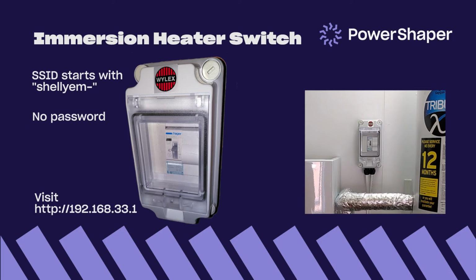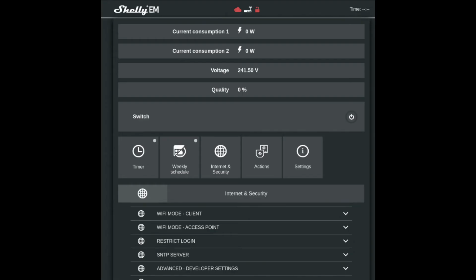192.168.33.1. You will see this screen. It can be slightly different depending on firmware version. You might want to check here that if you press that little switch button that you can hear the Shelly relay clunking on and off. That shows that the relay is under the control of the switch, which is great.